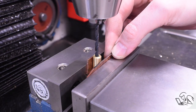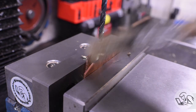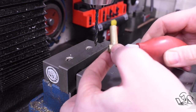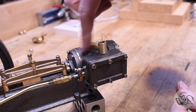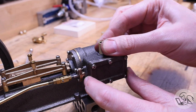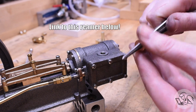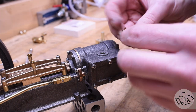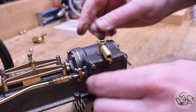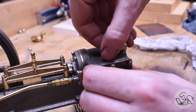At the moment it's a tee shape but not a tee pipe, so let's fix that by lining up the long section with the drill and drilling straight down between the threads and into the cross piece. Blow out the debris and our tee pipe is all done. Let's thread it into the steam chest and see how it lands. I had tightened it in place earlier and marked the position on the cross pipe so that after fish-mouthing and soldering it would land in the right place when tight — and I missed. Yeah, that never really works. So it's time for a copper shim. I've got one that's almost the right size so I'll open it up a little bit with a tapered repair reamer — very handy for this type of thing. If it doesn't line up you can just keep adding shims, but I didn't want to go thicker because I don't have a lot of threads, so instead I went thinner. I got the emery paper out and thinned down the copper shim, and that worked perfectly — a little elbow grease and we've got a perfect fit.